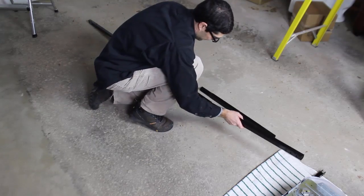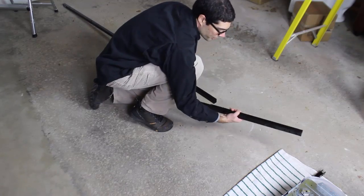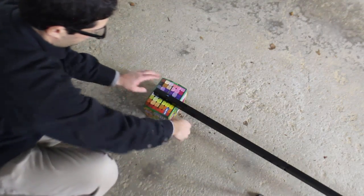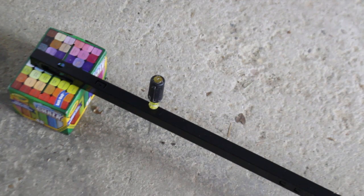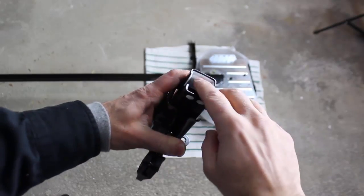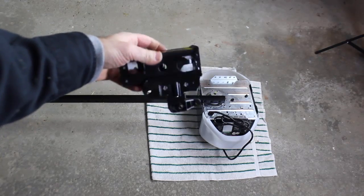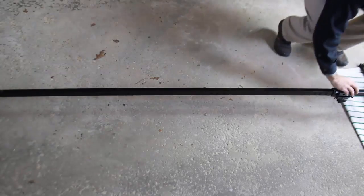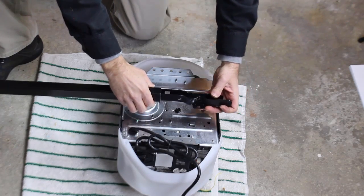Put the rails together by hand. If you have trouble doing this, you can use a rubber mallet to lightly tap them together. Set that aside and put it on top of the garage door opener. Put a box on the floor and rest the rail on top of the box. Put a screwdriver into the hole in the rail. Double check that the trolley has four plastic tabs in it, because those tabs allow the trolley to move smoothly on the rail. Make sure that it's oriented the correct way before you slide it onto the rail, then slide the trolley all the way down to that screwdriver.